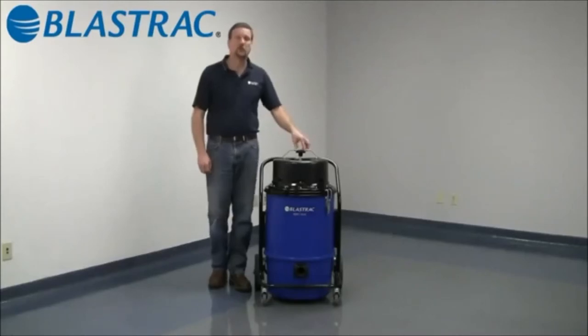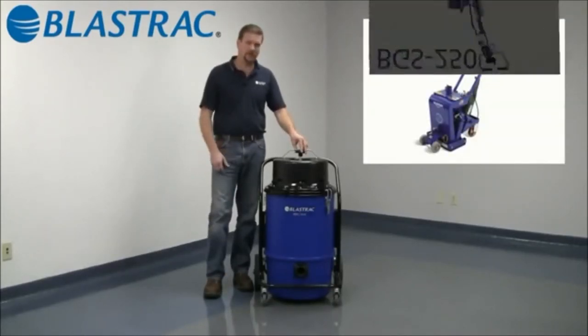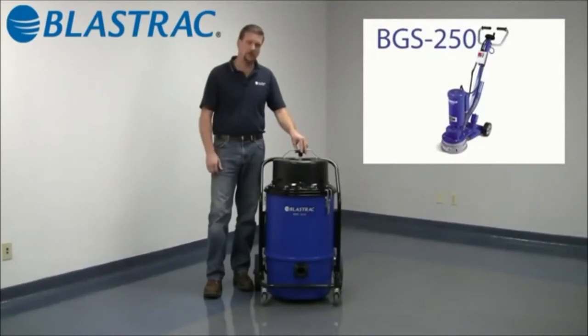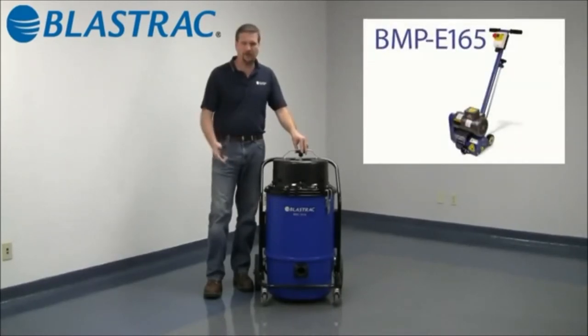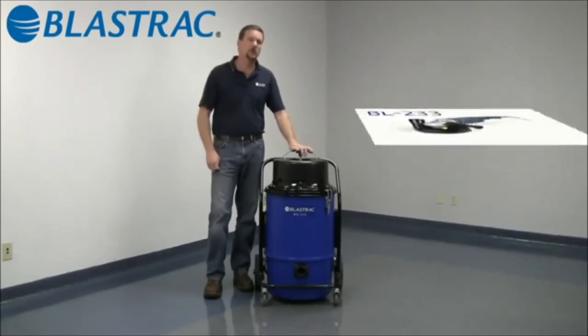We pair this with many different tools — our 18DEZ portable shot blast cleaning system, our BGS 250 10 inch 110 volt grinder, our BG250 230 volt grinder and gas power grinders, and it can also be used with a multitude of scarifiers in 6, 8, or 10 inch widths. Another great feature: it can be fitted with a Y splitter to allow you to run two hand tools at the same time, such as two 7 inch grinders for edging work, or a cutting tool and a hand grinder — all can be done with the 1216.